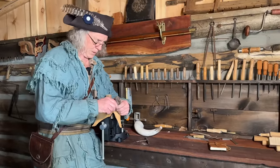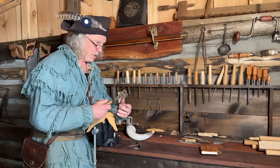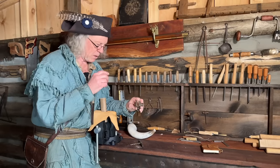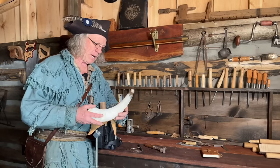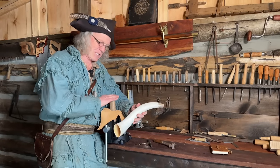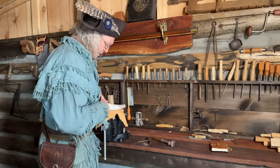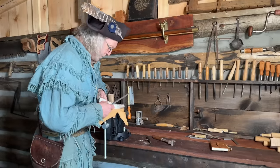About my shop — I've got one, two, three, four, five vises, including a handheld vise. I use vises for everything; you can't build things with one hand. You need a hand vise, for example, for filing out the small parts of a lock system. With a horn, as you can imagine, that's a hard thing to put in a vise. Back to Scott and Kathy's book on recreating the powder horn — the best advice I got out of that was this arrangement: a piece of leather to protect the horn, and an old broken hammer from the blacksmith shop as a brace to use while you're filing. So we're going to start by creating these flats.